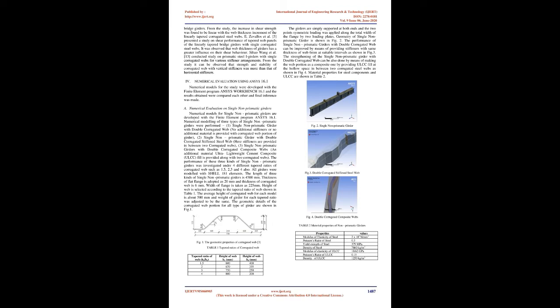The purpose of this paper is to obtain numerical modeling results on single and dual linearly tapered girders (non-prismatic girders) with double corrugated webs. A tapered girder is wider at one end than the other, and the tapered ratio is the ratio between maximum web height to minimum web height. The effect of flat flanges (FF), hollow flanges (HF), and composite flanges (CF) on the performance of non-prismatic girders with double corrugated composite webs (DCCWG) was also investigated.